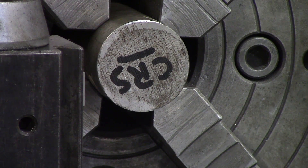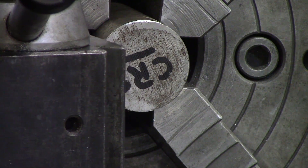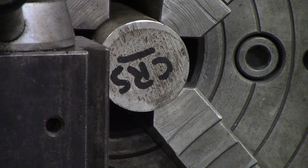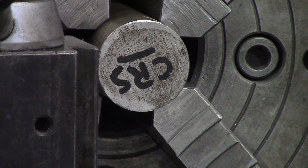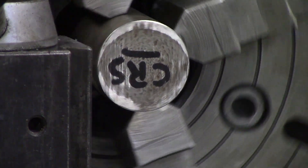That way I can rough, and then I'm going to switch and change it as if I was going to turn the part and cut with the front side — basically just the tip of the insert — for my finish pass. You can also finish with that exaggerated angle, but I'm just going to change it around to show you guys you can cut it either way. With this typical type of insert, it looks as though I can position it so it will turn just fine and also face it and it will be rigid. The only time you really want to position it at that angle is if your insert does not look rigid or if it keeps chipping. That's just a general rule of facing: you can always cut with the back side of the insert and then move it back around to start turning the OD.